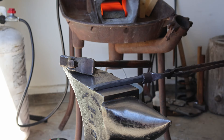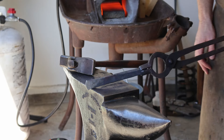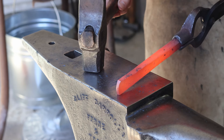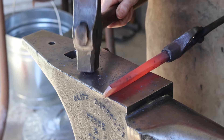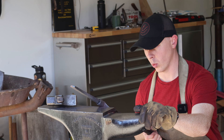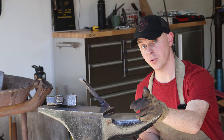I'm going to spin this back around. I think I've got it pretty well where I want it, where it's just got a nice taper that comes back to the struck end and tapers forward really smoothly all the way down. I like the way that turned out. Now I'm just going to take this heat to kind of true this up and make sure that everything is as close to a smooth taper as I can in both directions. That is going to do it for the forging portion of this video. I'm pretty happy with the way this thing has turned out. I'm going to let this cool down and then get to the grinder and grind in the tip of this chisel so we can get ready to heat treat and finish this thing up.